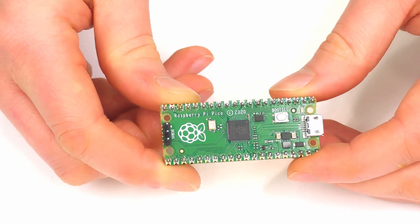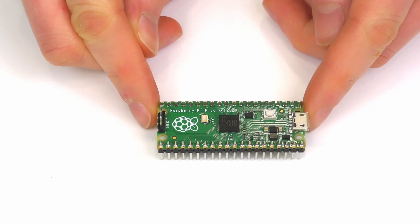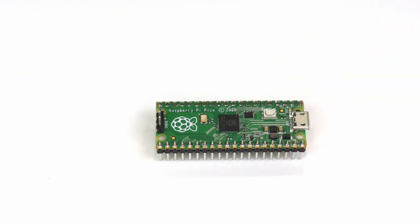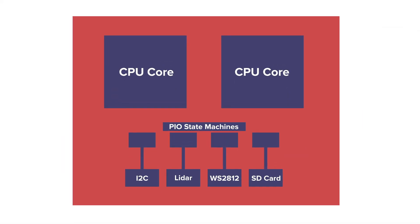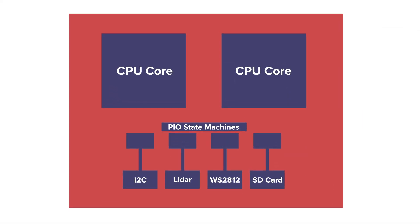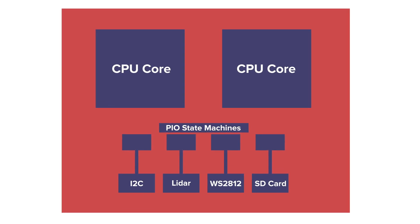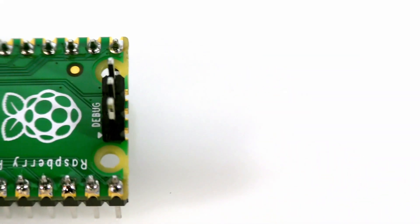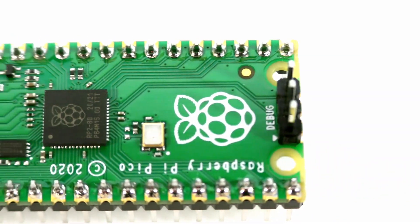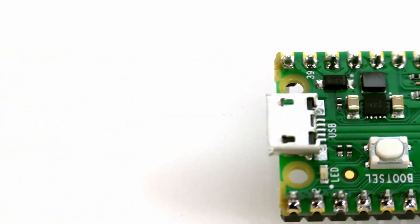That's where we get the Raspberry Pi Pico. It's very different in this regard. The chip — a fully custom designed chip from Raspberry Pi called the RP2040 — supports the creation of various state machines. These state machines are able to control and toggle pins and also contain their own dedicated hardware to keep track of states and buffers. This means dedicated hardware units can be set up to handle much of the I/O required for custom peripherals on its own, freeing the CPU for other tasks.